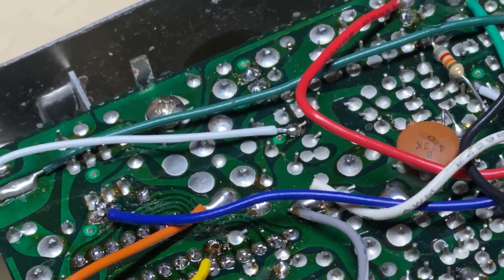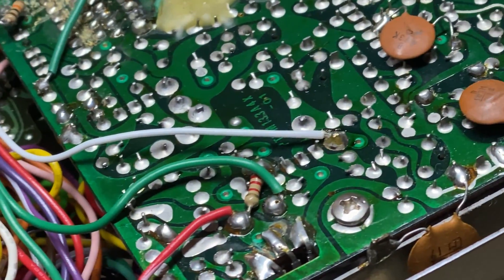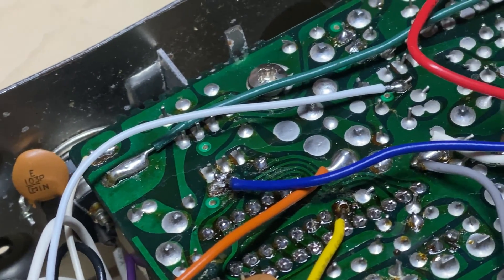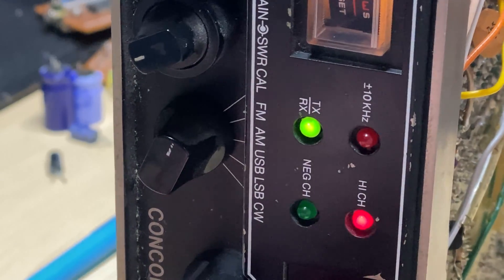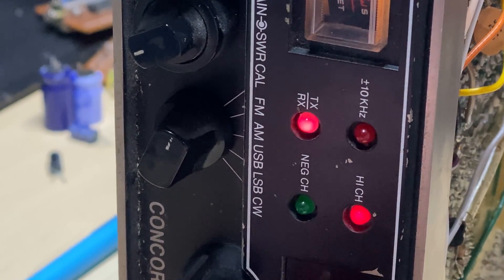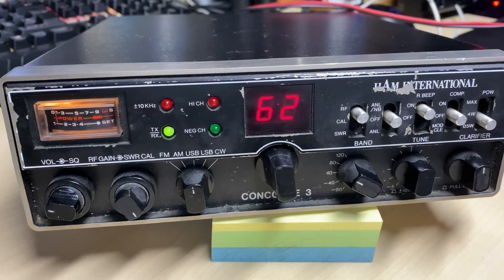There's our white bridge wire. While in there I measured the AVR line which runs all the way down and — it was open circuit. It passes right past the AVR capacitor and sure enough that was our issue. As you can see now the green light goes out correctly, the radio goes into transmit, we have full power, and everything is working correctly. Like I said earlier I should have checked that trace a lot earlier, but you live and learn.